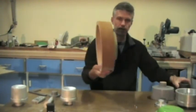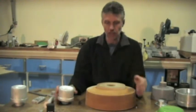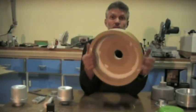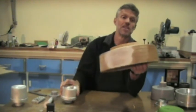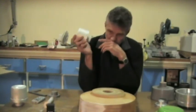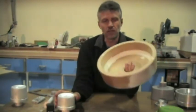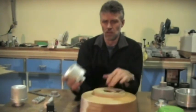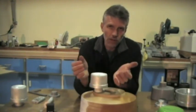This one being a little bit different, without having the hub, I'll probably have to put a feeder, because this is 20 mils thick. I've made this so I have 20 mils of aluminium thickness everywhere. So everything's dead on 20 mil, so it's going to do a fair bit of shrinking, and it's going to have to have a large feeder. This is not going to be big enough. I think this is going to weigh something in the region of 6.5 kilograms. The feeder, I'd probably put about a 4 kilogram feeder on it.